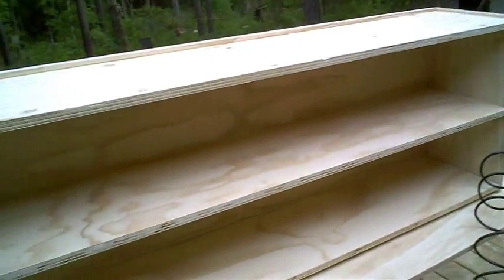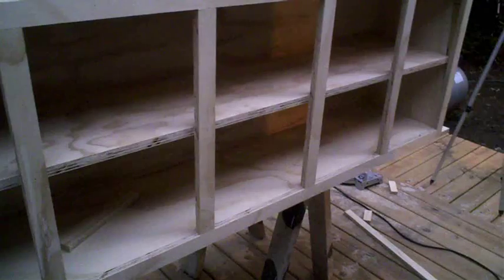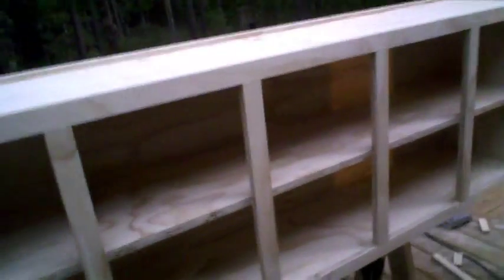Let's start trimming it out — get my saw out here and get some trim. As the sun goes down, this cabinet is now faced out. Those are all 12-inch doors, except for this one which is 11 and a half. So it'll be six doors altogether. I'm going to put screws going into the back of the shelves just for more security.